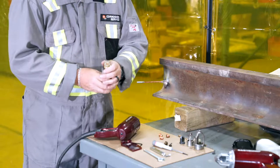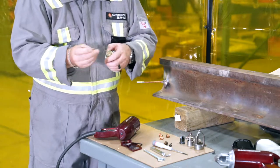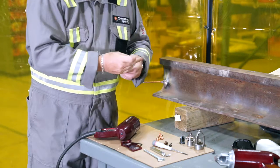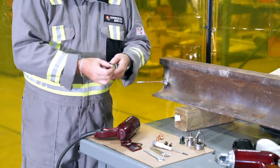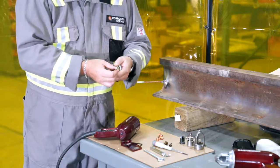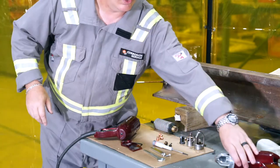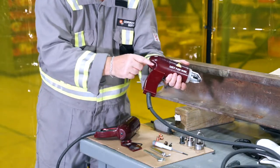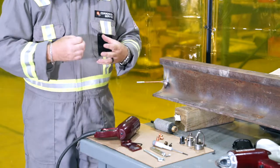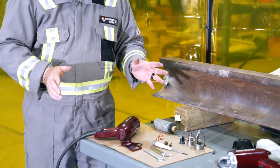In the middle of the gun, when you depress the gun you can hear the spring. Inside, as part of the 8mm pin, is the fuse wire. When the pin is inserted into the gun, the fuse wire inserts into the contact nipple. If you don't eject your fuse wire after every shot, you risk fusing or melting that wire inside the gun and you won't be able to do any more shots. That's why it's critical to eject the fuse wire after every shot — always press the ejection button before loading to make sure there's no fuse wire in it.